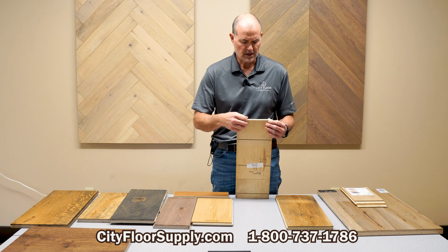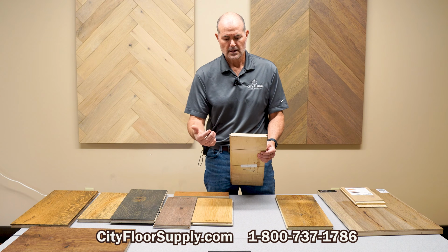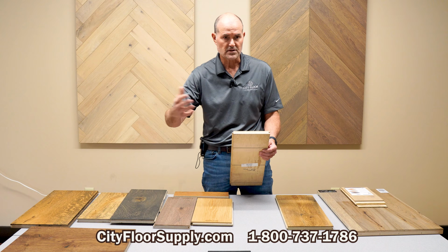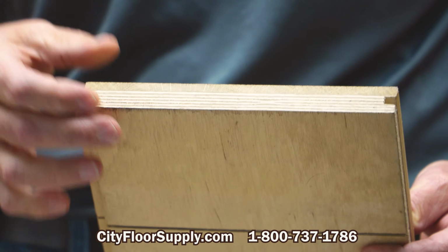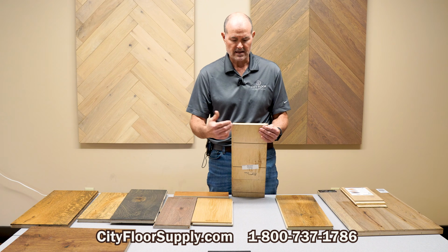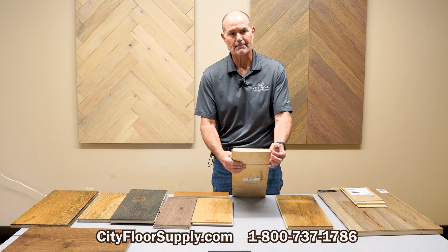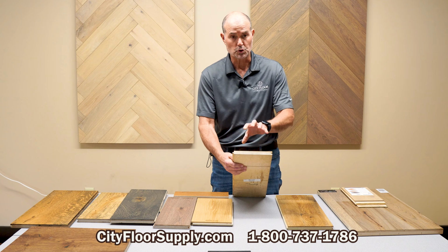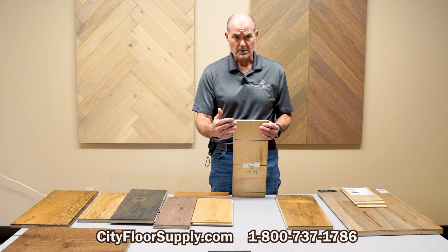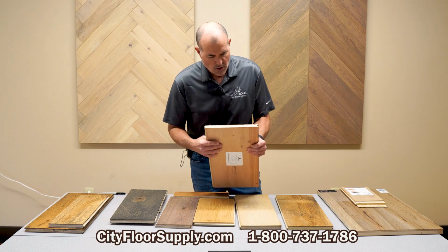It's a very, very good quality engineered plywood core product. It can be 7 layers, 9 layers, or 12 layers. It really depends on the thickness of your overall floor and what your wear layer is going to be. There is some engineering to that, as far as what the base plywood thickness is going to be versus your top wear layer of the hardwood that's glued to it. The adhesives I was talking about earlier, that rotary peeled technology was great at consuming a lot of the log.